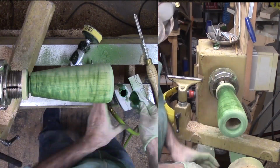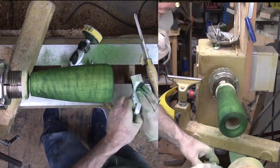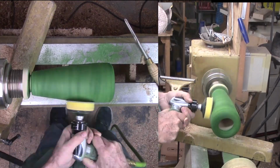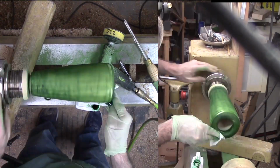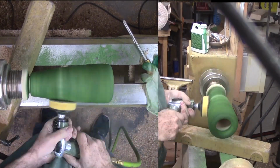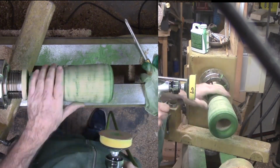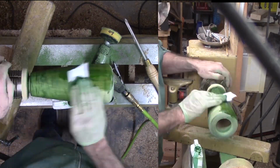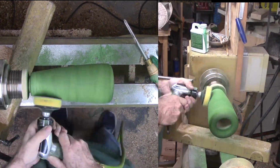Then immediately apply the same dye, the same as before. Had I sanded before any dye, the wood would look very different. Again, dry and power sand with 220 grit. This is getting repetitive. Apply dye. Dry and power sand with 320 grit. Then another application of dye. Dry and power sand with 400 grit.